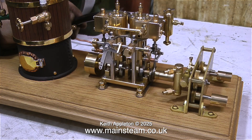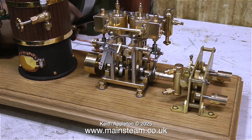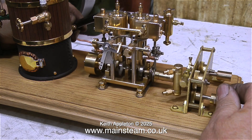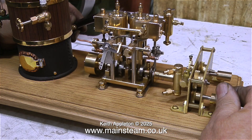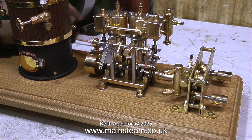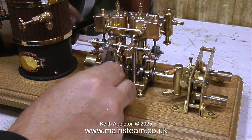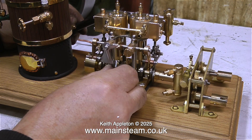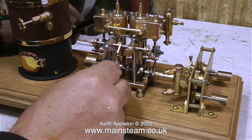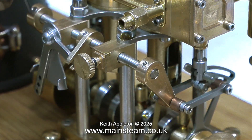Once upon a time I was running a model steam engine and as it was running I applied a very small amount of rapeseed oil to the bearings, and suddenly the engine went a lot faster — I think that proves the point. A friend of mine, the late Bernard Walker, used to work on the railways. When I told him about the rapeseed oil being an anti-friction additive, he told me they used to go to the superintendent's office and ask for a drop of the special stuff if they had a locomotive with a central connecting rod that was running hot, or even to cool down hot axle boxes. You live and learn. I still add some rapeseed oil to my oil mixture — but I do not add it to steam oil — and the bearings of all engines in my personal collection are in really good order.